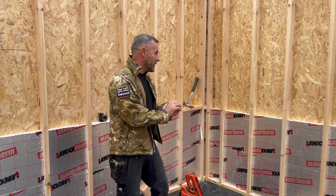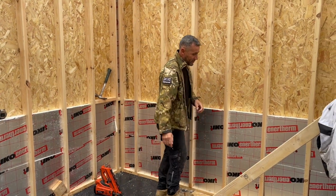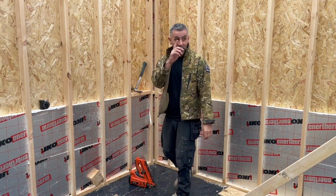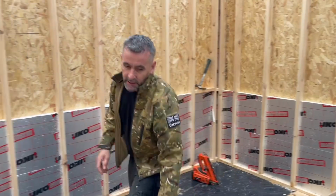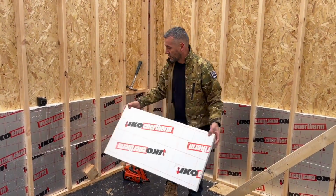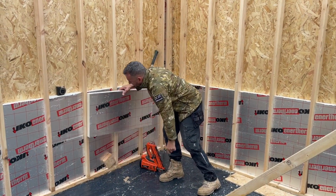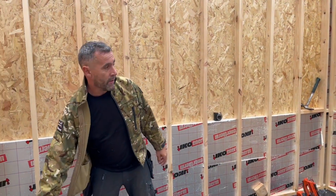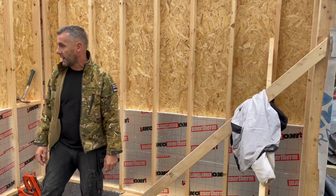Right, it's just a quick little video to show you how we get our noggins in, the best way we've found of doing it, and the fastest way, and the most level way as well, because somebody's asked me. So what we do basically, we use our insulation, the cavity batts, which are 1200 by 450. We cut them down to 450 length, and we put two bits in, which gives us 900. Davey will pan round the room, and you'll see a full level line of insulation all around the room. See that, Davey? Yeah.